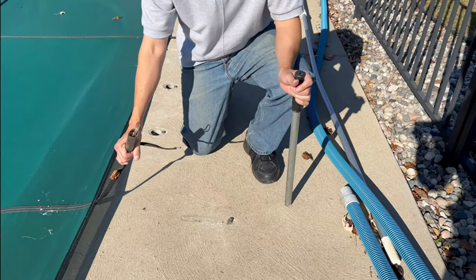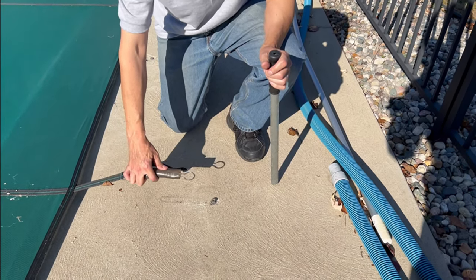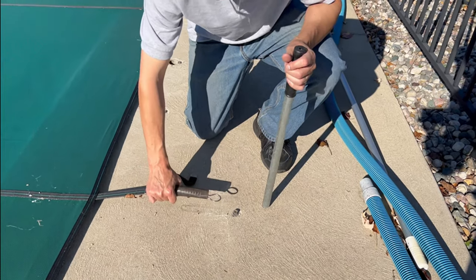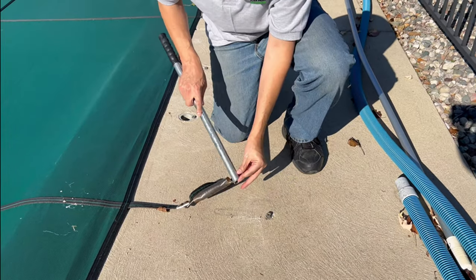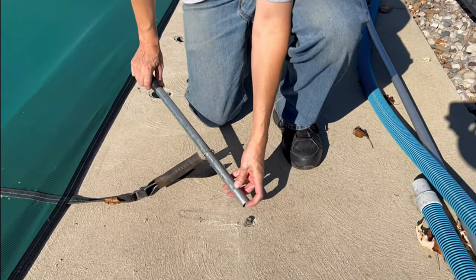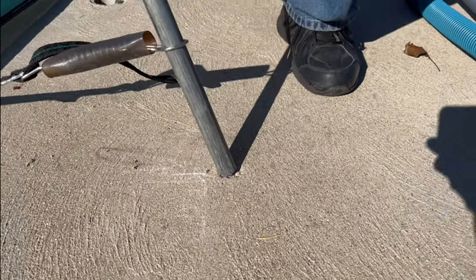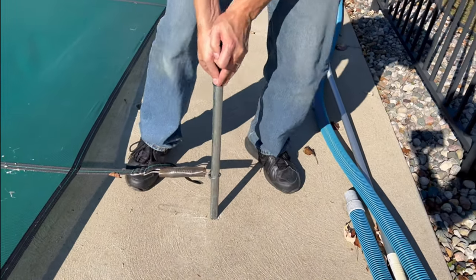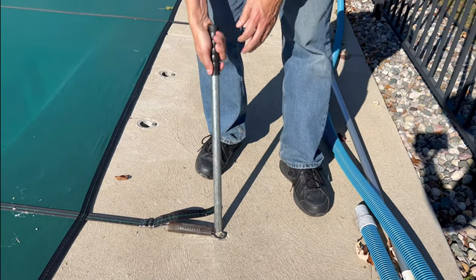When you're installing the safety cover, at some points there'll be areas where you can't pull it on all the way — no matter my strength, I won't be able to reach that anchor point. So they come with these installation pipes, which are surprisingly simple. You simply install the pipe with the hook edge over the anchor point, push it down, pry that strap over, and simply step on it.